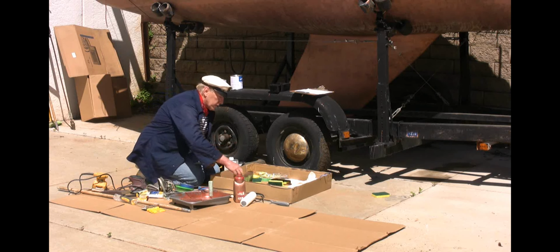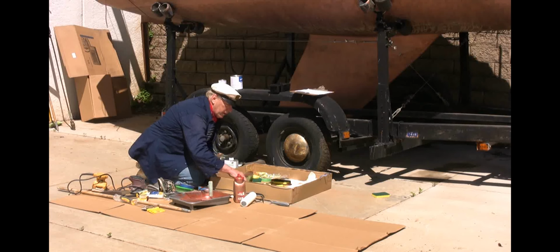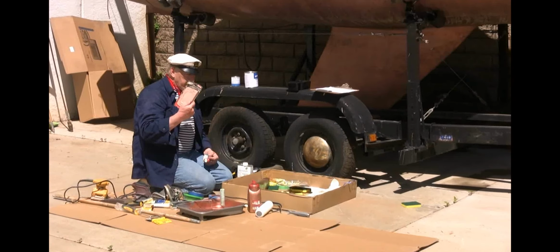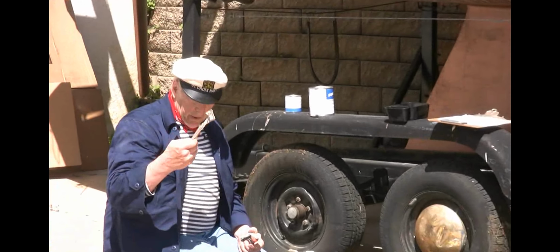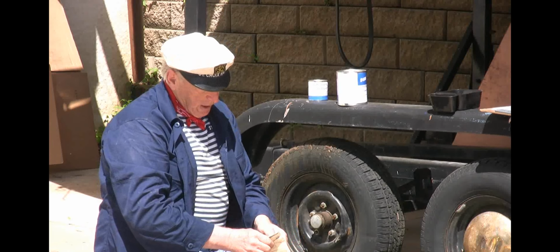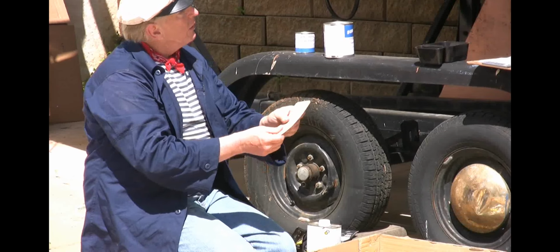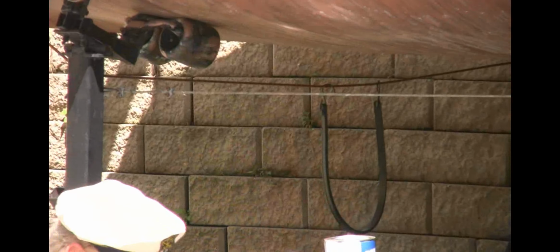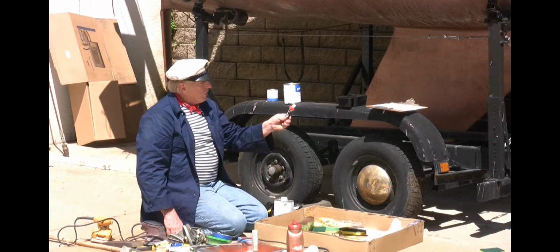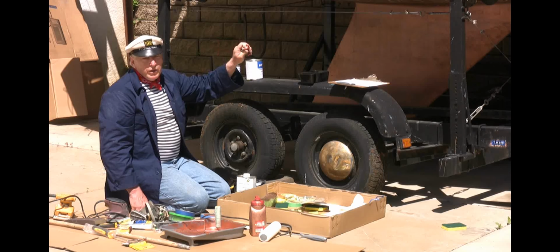Other things I'm going to use, as we'll talk about later, we'll talk about doing a little fairing on the bottom. And we use just little plastic automotive Bondo cutting knives for doing that. The longer ones are nice because they can shape to the boat bottom a little bit, and so you can do it when you're striking off areas. And we use just a soft Bondo glazing compound because you can catch those little tiny nicks. You don't have to do any mixing.